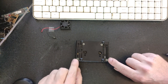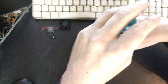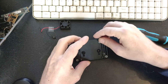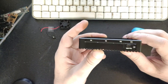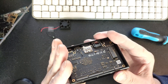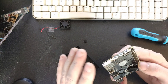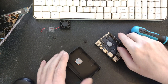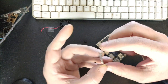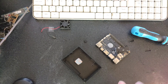Let's open it. There are four screws here. Now we can lift this up. To get the board out, I can push here on the GPIO pins. There it is. Here you can see there is thermal paste on here, and here are my two copper shims with thermal paste on each side. These two copper shims with thermal paste are what makes it work great.